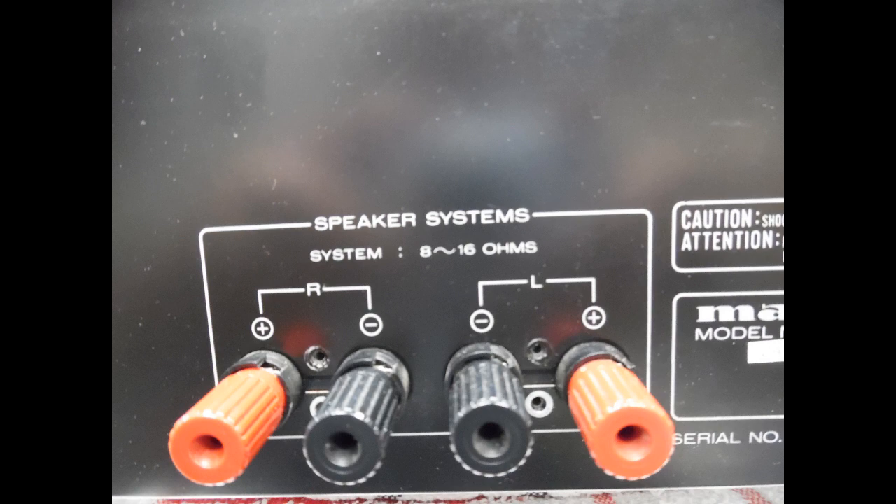When the back plate is screwed to the chassis, it connects electronically to the circuit. If you remove the back plate, carry out the repair work, and then power it up without refitting it — which is very common — on some amplifiers that's perfectly okay. But because of this common ground connection, it's a serious issue. Unless you have a bulb tester in circuit, you will literally destroy the output transistors and probably the drivers in the amp. So before any test after repair or service, ensure that back plate is secure and the speaker terminal securing screws are fitted.